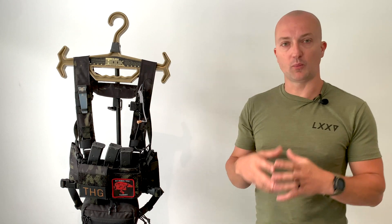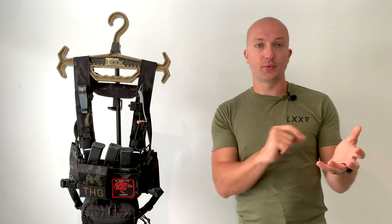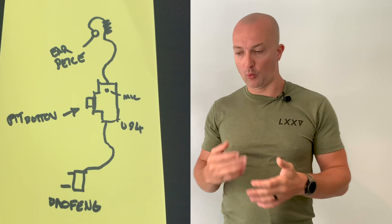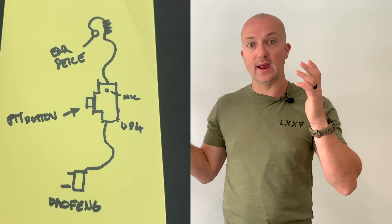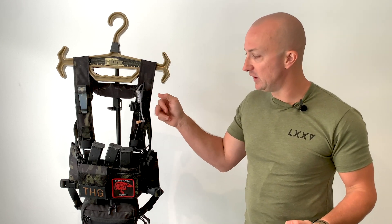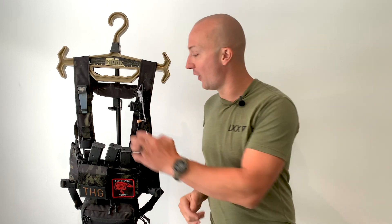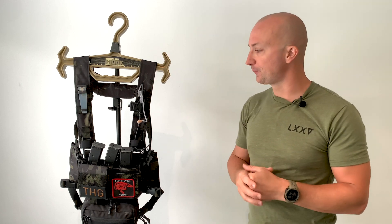I got back at about 3 a.m., scribbled a post-it note — I'll put that on screen — to JCI saying this is the sort of thing I want. I want to go from a Baofeng radio up to a U94, and I want the U94 to have an inline earpiece, a single-ear earpiece. The issue with that setup, as any comms guys will know, is there's no mic in line — this is just a PTT for listening. So what I asked JCI to do was put a microphone inside the U94 with a small pinhole so that the audio goes through to it.